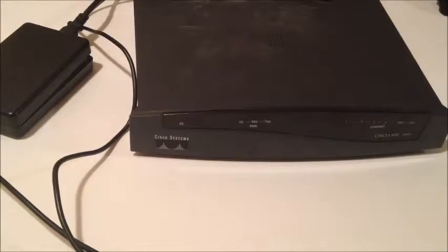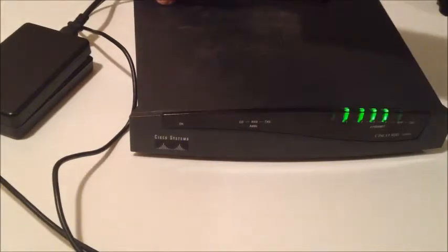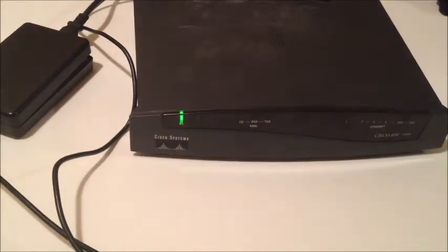After replacing the filter capacitor we're pretty much ready to test this again. I have a bit of short circuit protection in this just in case, but I'll show you that in another video. Powering it on — and we have lights this time. It looks like we've got power to the unit. It seems like just that one filter capacitor was blown and that's what was causing the problem — a pretty easy fix. Normally you would have more components blown with it, but it's good to have an easy start. Please add all your comments and opinions below, and thanks for watching.